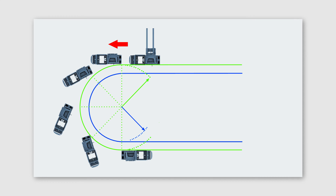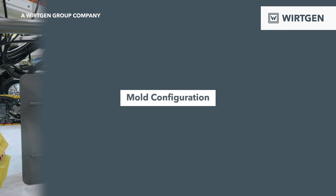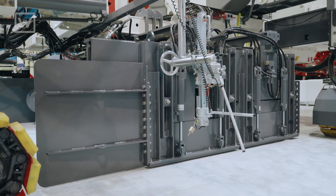Although it's a fairly large machine, the SP25 can be used as a curb and gutter machine capable of tight radius. The SP25 has a very unique mold setup that is only seen with this machine in this size configuration.